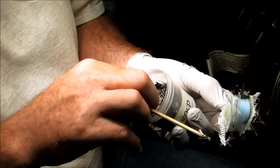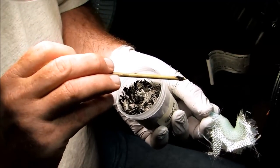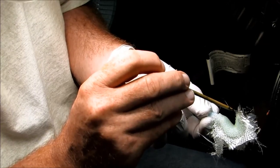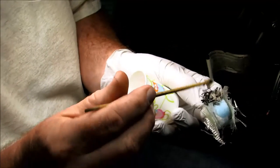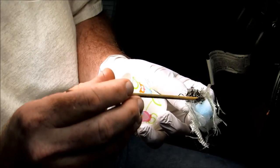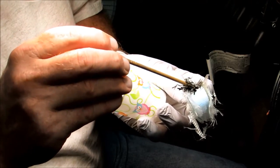So, because it's a sharp point, I'm not going to be able to get the glass to roll around it. When we look at the side view here, we're talking about this point right here, which is a relatively sharp point, comparatively speaking, and I'm not going to be able to get all these excess glass layers to make that sharp turn. So I'm just laying some carbon chop in here, and hopefully I'll be able to massage it and wet it out and get it to make a fillet, if you will, that extends from that excess glass on the front over onto the back side.